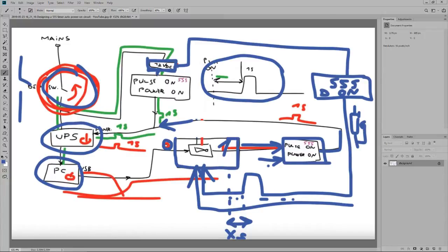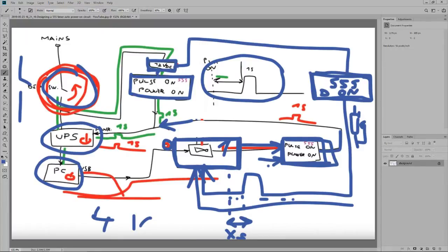So I'm gonna need in the end 1, I've built this one, 2 right here, 3, about 4 ICs. It seems right. I'm trying to think if there's anything else I'm missing, and I don't think so. I thought it was gonna be a little bit easier, but you really can't do much about it because there really is this dance around with timing values. It all has to be orchestrated pretty nicely, not to fail with a pulse in the wrong timing, because then everything will either malfunction or not work at all. It is simple to build nonetheless. I mean, it's just 555s and an inverting gate.